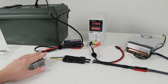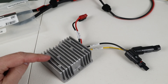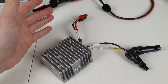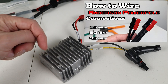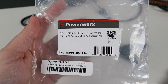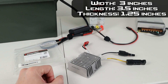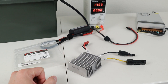Overall, the size and form factor is really nice, and it's really efficient — it's actually not hot at all even when charging near 300 watts. When you purchase this, you just get the bare charger. It does come with MC4 connections to connect your solar panel, labeled with proper polarity, and the output is Anderson PowerPole. You'll need to buy an adapter for your battery connection, or you can learn to crimp and set these up yourself — I have a video on my channel about that. This charge controller would be perfect for anybody wanting a compact setup, whether in a DIY battery box, a van, or a truck for camping.